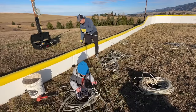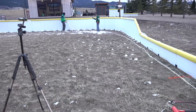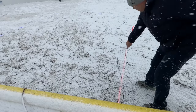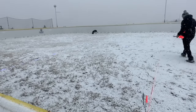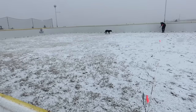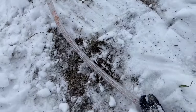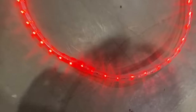Putting in the under ice LED lighting took about three to four hours with the preparation and filming, so having it done early in warm weather was worth it to me. But if you do yours right before the liner goes in, then a snowfall won't be something you'd need to worry about. I decided to mark the rope lighting with utility flags in case we get a lot of snow prior to the liner going in, so I can be extra careful clearing snow around these areas — this way you'll avoid catching rope lighting in your snowblower auger and having to do a last minute repair before flooding the rink.